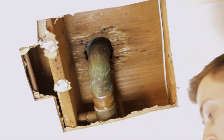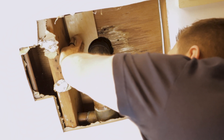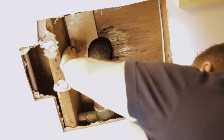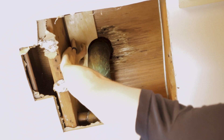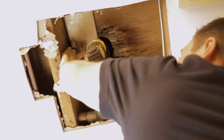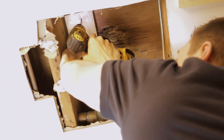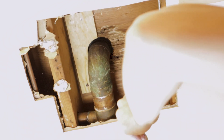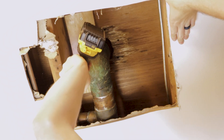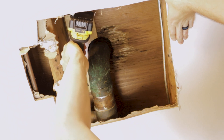My microphone came unplugged so we'll just be doing a voiceover here. You can see I took some scrap three-quarter inch plywood, cut it to the size I'd pre-measured, used a six-inch hole saw to cut a hole in the middle, then cut it in half so I could fit it over the pipe. I'm fitting one side in - it's important to note I used hardware that won't go all the way through the subfloor, because you don't want those screws to go up and hit the tile and buckle or damage it.